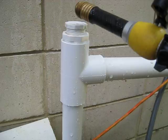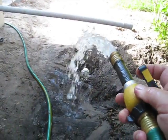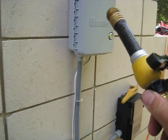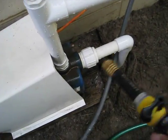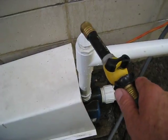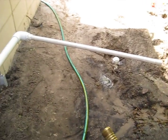When we initially primed the pump and got the well and pump system going this morning, what we did is we unscrewed this cap. I have this little device I put on the end of my hose — it allows me to turn the water on and off. It's got a little piece that fits down into the top of this T like this. All we do is unscrew this part, screw this in, turn this on, turn the pump on up here, and let it run out through here. In the meantime, the pump is sucking water the whole time — it's created a suction which is pulling the water from the well. After a period of time, you keep water in here, then you screw this back on top, and shortly afterwards the water does finally start to come out. That's what we did this morning.